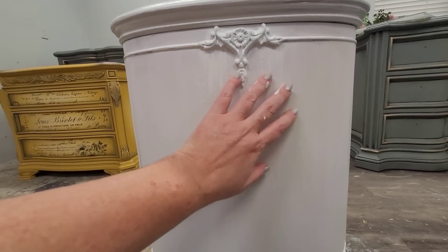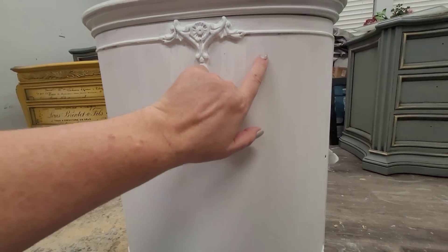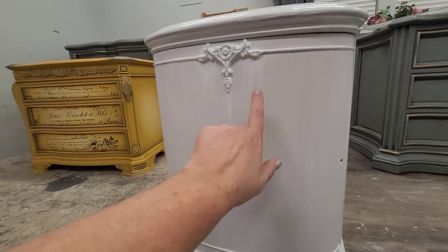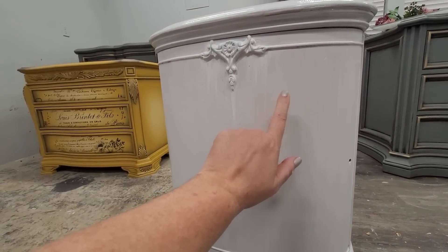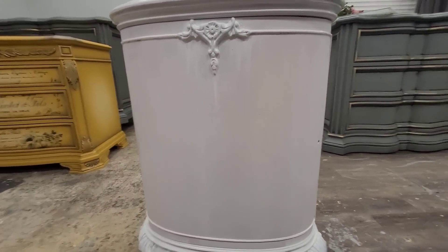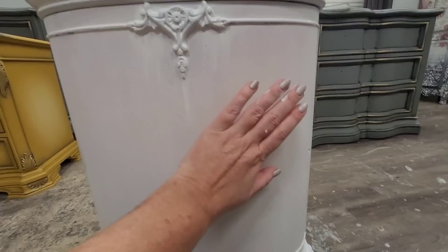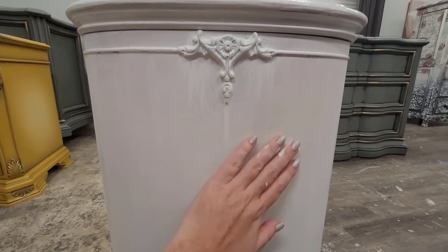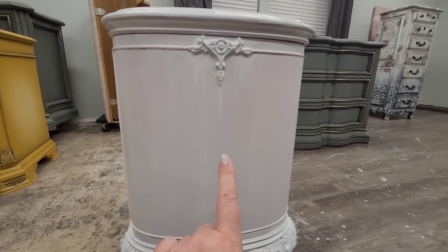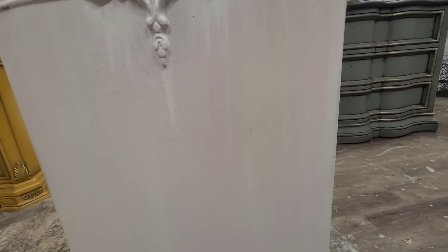My first coat of Boss is just about dry and I wanted to show you something coming through — there is definitely a yellow spot right here. Boss is a stain and odor blocking primer, and had I not used it this yellow spot would have appeared in my paint. Even though this was a really light blonde colored wood, I know by this that it would have been a bleeder. You always want to prime underneath your whites to prevent stains from popping through. This is just my first coat, so I'm going to put a second coat on to stop that yellowing bleed-through.